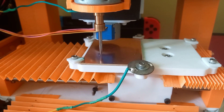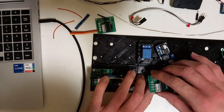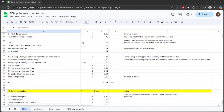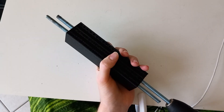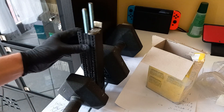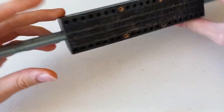You'll have to decide. Here are the notable pros and cons. The most interesting part for me is the hardware. I try to keep everything as cheap as possible. Many parts on the BOM are so common you might already have them laying around. The frame is made out of PLA parts, reinforced with M8 rods and filled up with cement. This is a very cheap combo. The total cost of rods and cement was less than €15 and makes for a very solid frame.